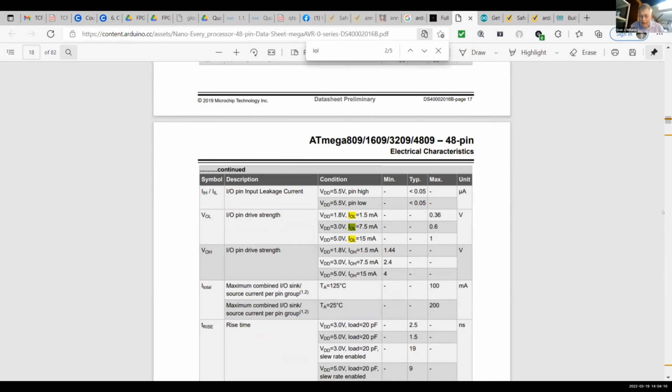Yeah. So for VDD, it depends on what you drive the chip at. At 5 volts, the minimum is going to be a 4 volt output. It looks like VOH, V output high. So that's the parameter we are looking for. These are important things because you can burn out your equipment, and the chips and LEDs are expensive now. Absolutely. So that's good. Very good question.